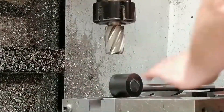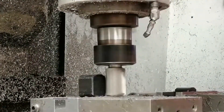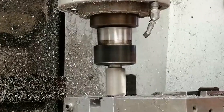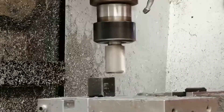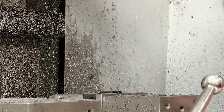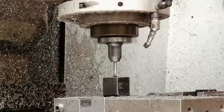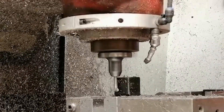The idea here was to machine all six faces of a die in just two settings. A large chamfer on the end mill lets me cut the chamfer all the way around using the same tool that does the top and the profile. And this ball end mill is cutting into the block from five different directions, all in the same setup. Saves a lot of time and honestly it's just fun to watch.